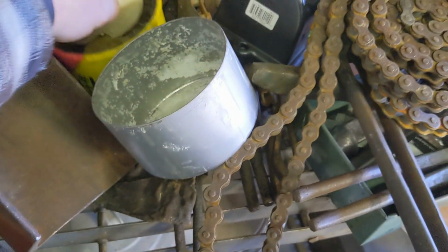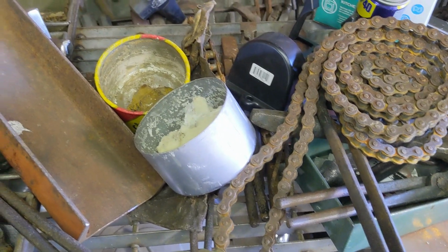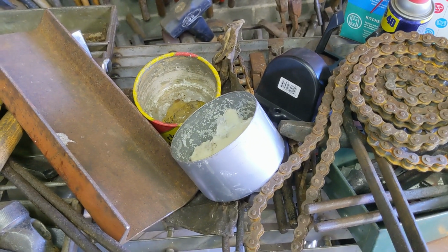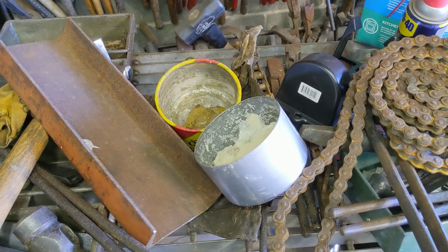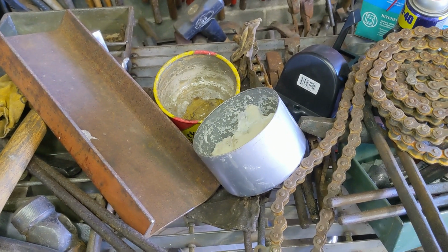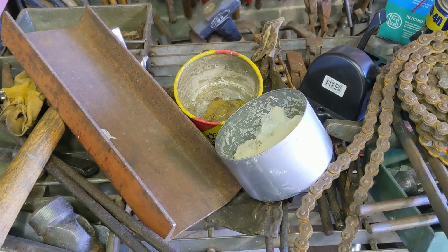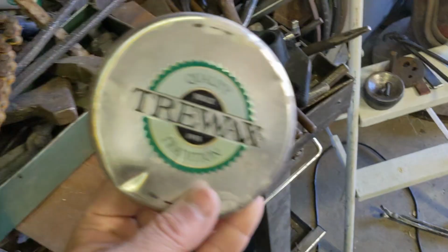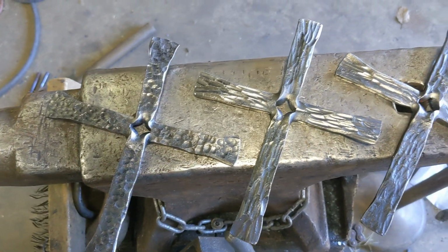And that's what this block is. So beeswax is nice. It smells really good. If you got a good way to get beeswax, I would do that. But if not, there's alternatives. Almost any kind of floor paste wax that's just normal colored would be good. Blacksmiths used to use a mixture of boiled linseed oil and turpentine and beeswax to make something like the floor wax that we use. So it's very similar, something that can be applied cold if need be. So anyway, this is what I'm using now. There's other stuff out there, probably all about the same stuff.